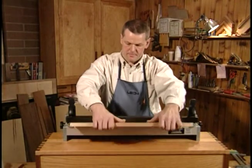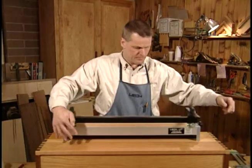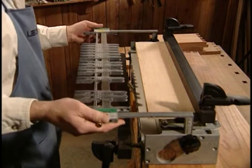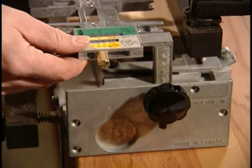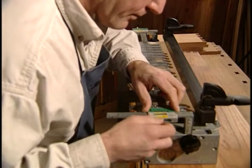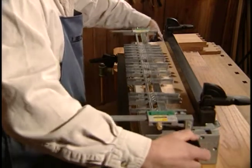Make up a spacer board as specified in the user guide and clamp it in the rear clamp. Place the finger assembly on the support brackets in the through dovetails pins mode. For initial adjustment, set the scale to the 1/2 inch setting. Always support the finger assembly with the spacer board when using the front clamp.